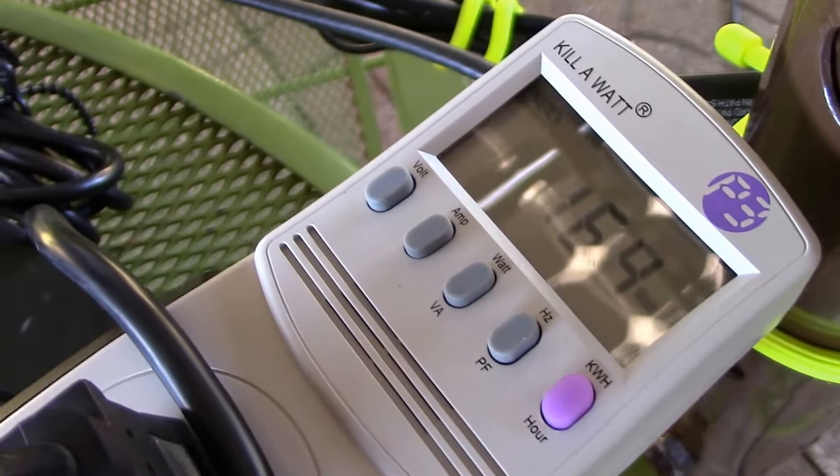It's sitting at 44%. Every hour I took a reading. At one hour, still inverting, it went up 5% on the fuel gauge with about a 15-watt load — so it was actually charging and inverting at the same time. Then I turned off the inverter. At the second hour mark, it's now sitting at 64% — up 18%. Turning that inverter off will definitely increase your charge rate, make it quicker.